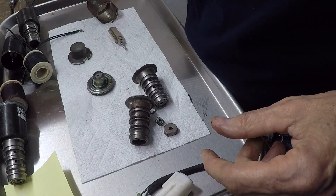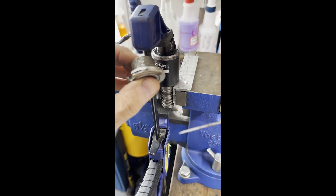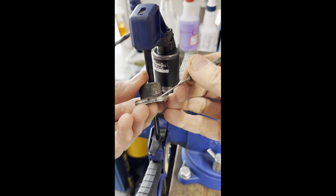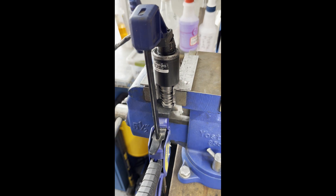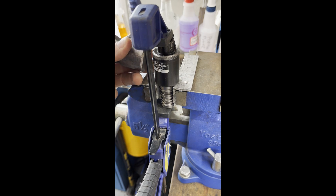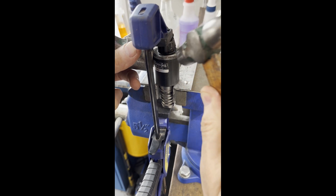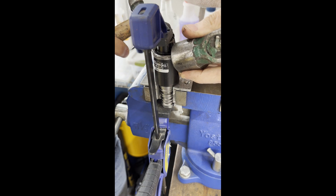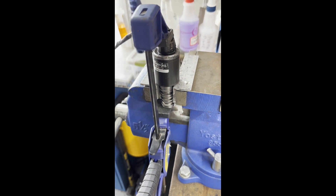Here's what I'm trying to do to reassemble the canister. I took that top hat piece and I hit it with a grinder — this one I haven't done anything to — and tried to cut that chamfer a little deeper, just bevel it off at 45 degrees. It gives you more room for the metal to bend over. Then I've got it clamped up in a little clamp to compress those O-rings and try to keep them tight while I put it back together. To turn that flange over, I hold a heavy hammer on one side and tap on the other, and try to get that flange turned back over where it was. Hopefully that extra lip I cut on there will give it some room to bite, and I'll know soon if it's going to leak — I'll put pressure on it.